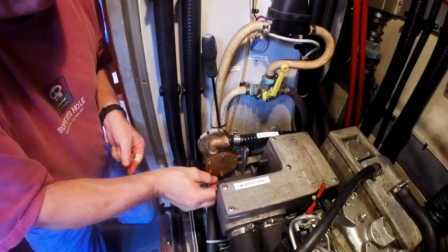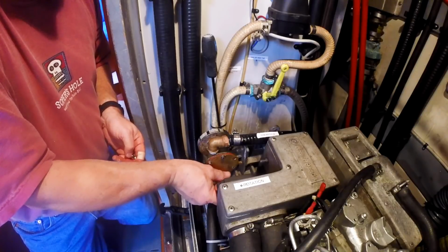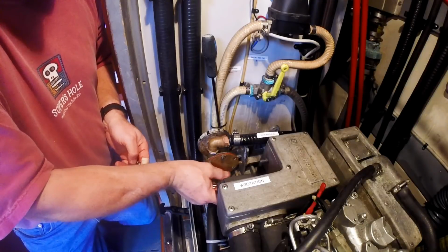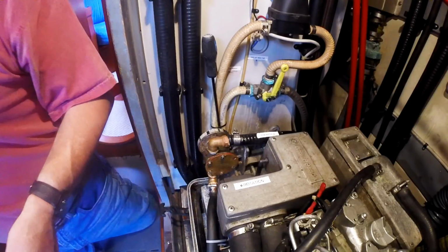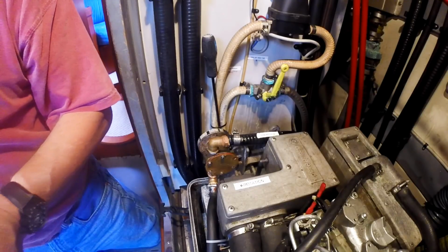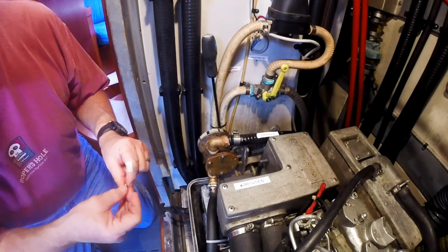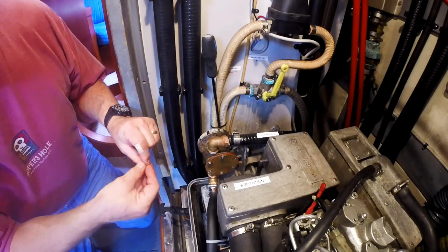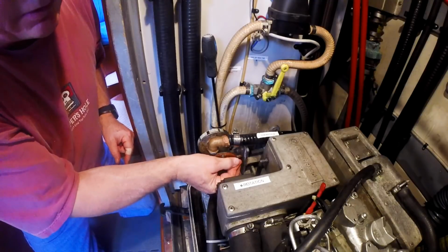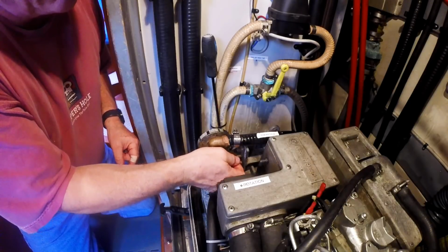Guy at the marine maintenance facility was telling me that they had an Oyster come in that kept having the valve rods and tappets come out of alignment and out of adjustment, and they finally ended up having to pull the whole engine and found out that there was a screw, a nut or a bolt, I'm not sure which, that was down inside the engine that was not part of the engine. Somebody dropped it in through the oil filler cap, most likely, and it kind of worked its way down through the engine, doing damage along the way.